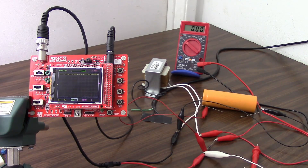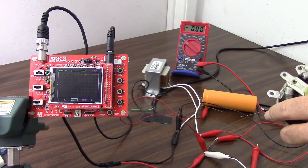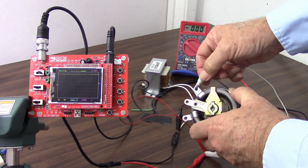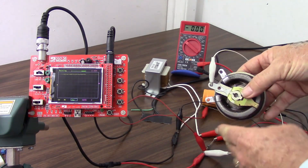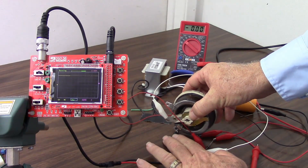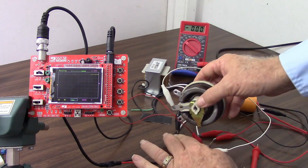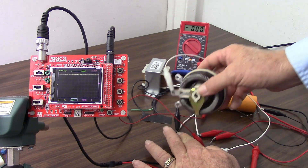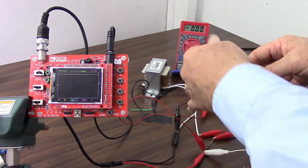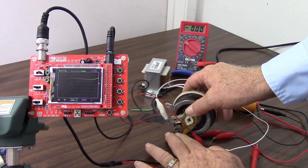Now let's give this thing a little more of a taxing. I'm going to hook this lead to the middle connector here and let's make that about a 50 ohm load — let's see what happens on the oscilloscope. It goes down even further. Let's make it an even bigger load — about a 25 ohm load. Now it's not only going down, but look what's happening: it's getting ripply. Let's make that about a 12 ohm load — don't want to get this too hot. Yeah, I've got lots of ripple there. It's not nice flat DC anymore.